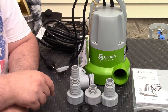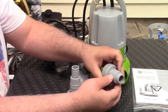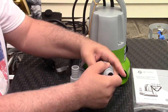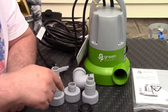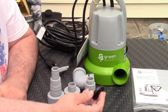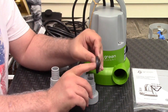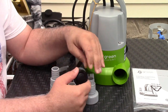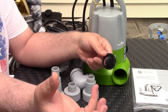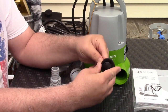You also have one-inch fittings you can cut and put a hose on with a clamp, so you can do one and a half inch, one inch, or three-quarter inch. You also have the check valve, which ensures water flows only in one direction and won't flow back. As the pump pushes water out from the bottom, it can flow that way, but when that column of water comes back, it slams the valve shut and prevents backflow.